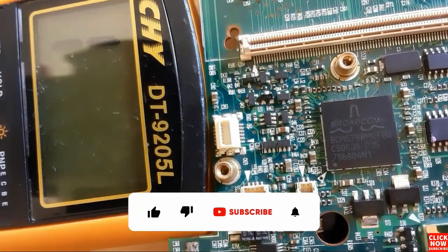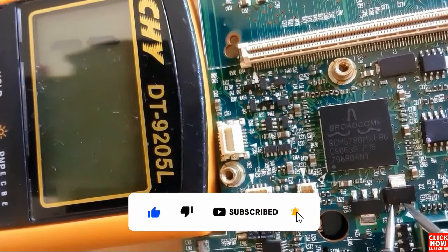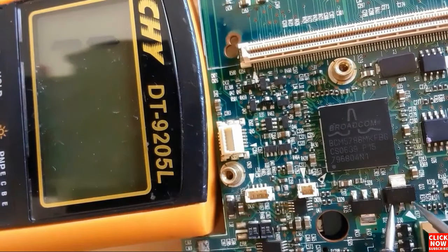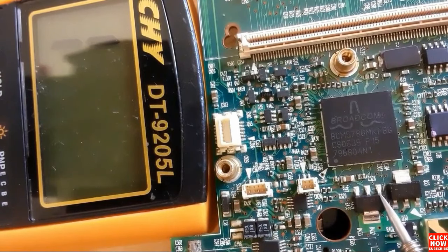If you get any buzzer or a low resistance in the multimeter, means the transistor is bad. So if we switch the probes, nothing in the multimeter. Okay, so this is a good transistor. So let's check the second one.